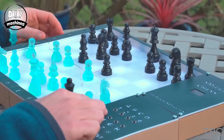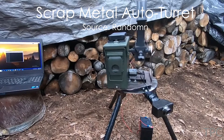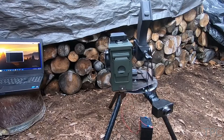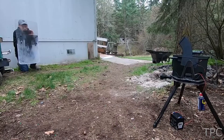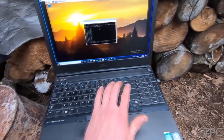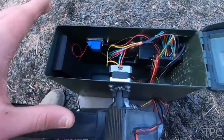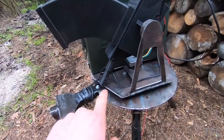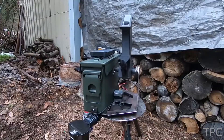With the USB power feature you can enjoy your game indoors or outdoors while sipping a cup of coffee. This is a homemade autonomous and manually controlled airsoft sentry turret — a fun project to play and learn something new. The webcam at the front continuously tracks the face of the target, and once detected the shooting mechanism activates and shoots tiny bullets at it. Via the Raspberry Pi's virtual network connection you can control this turret wirelessly from your laptop. Two stepper motors are used: one inside the ammunition box to position the shooting mechanism, and one at the bottom to control rotation. These motors and the cooling fan are powered by a 12-volt battery.